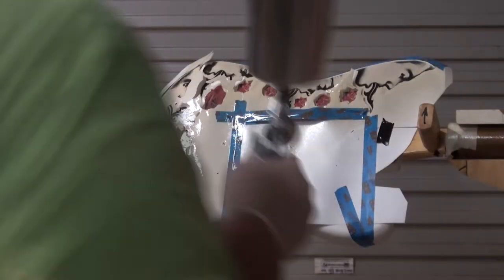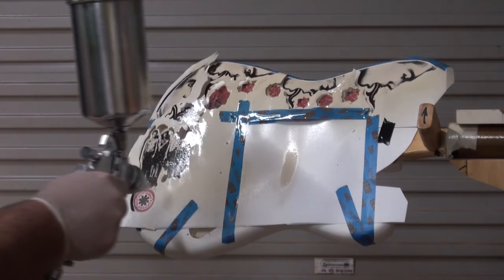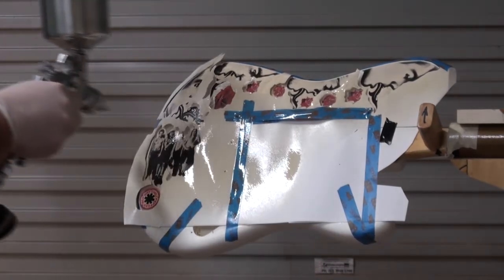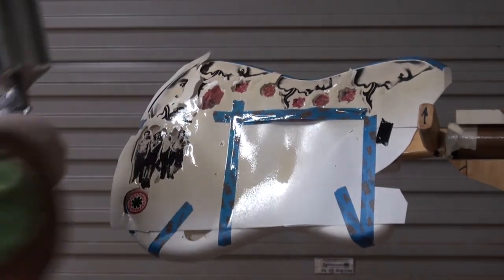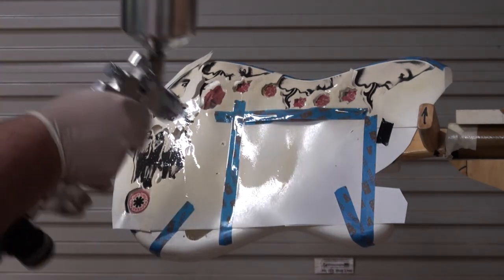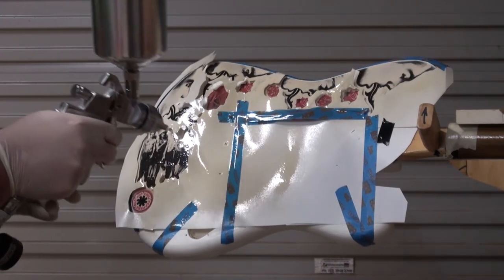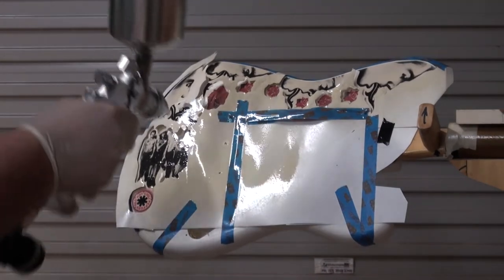Once I had sprayed enough clear coat protecting the images, I stopped. There might have been about 4 to 6 passes. The paper would have absorbed the first few passes alone. In truth, I got to the point where the layers were so thick that the bottom edge of most clear coated areas was starting to bulge, but did not actually form a run. These bulged areas would be sanded flat during the next wet sanding phase after both clear coat and white paint areas were done.